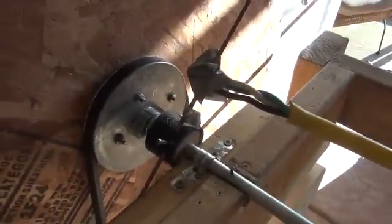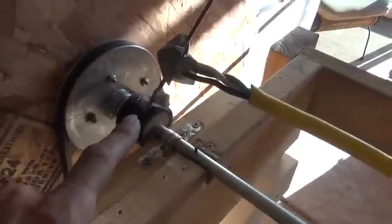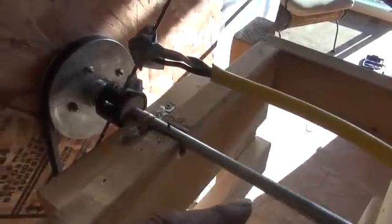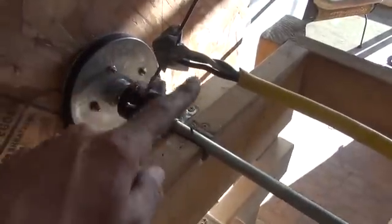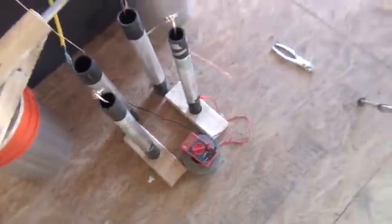Alright, so we've got that mounted on the same-side neutralizer bar. If you cross this over, it doesn't work. So if I have this over on the other side of the neutralizer bar from the block, you won't get a reading. If you have this on this side and run it to the other side capacitor bank, you're not going to see anything. You've got to make sure it's on the same side. Running that down directly into our meter and here we go.